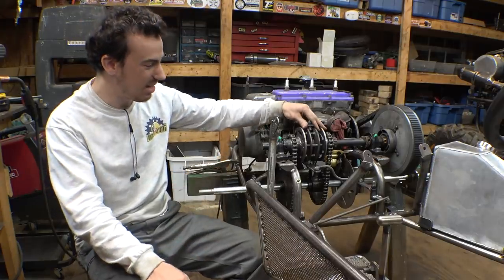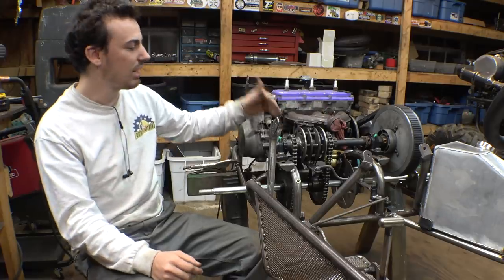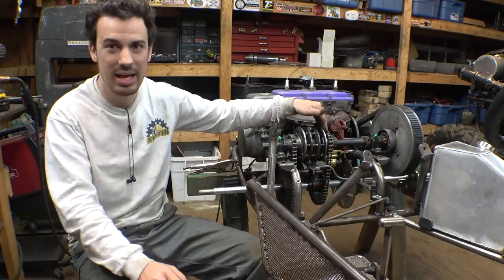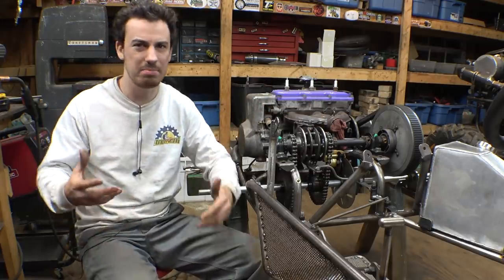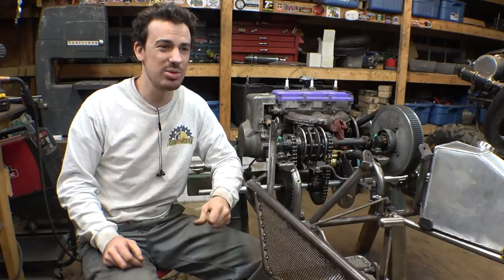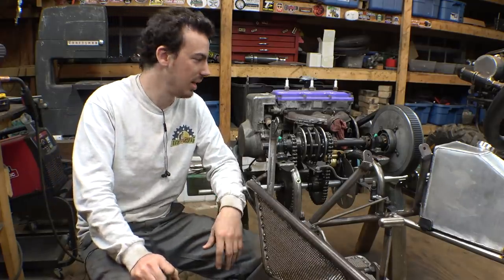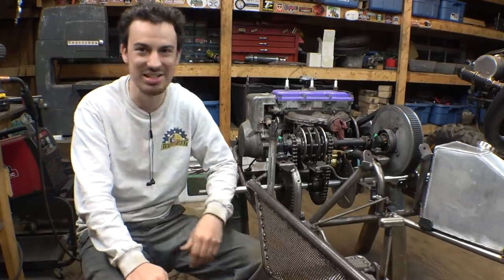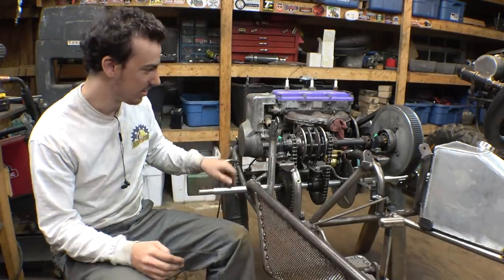Right now, I just have the gearing at like medium. The gearing is 3-to-1 in first gear and 2-to-1 in second gear. First gear, I believe, like a 3-to-1, is a pretty decent top speed, as well as pretty good acceleration, possibly wheelies and all that kind of stuff. And second gear is, who knows? Who knows how fast this thing's gonna go with 2-to-1 gearing?